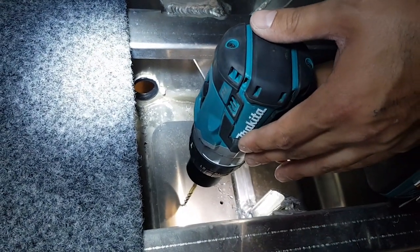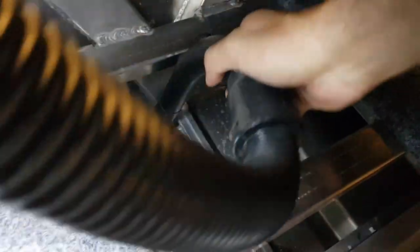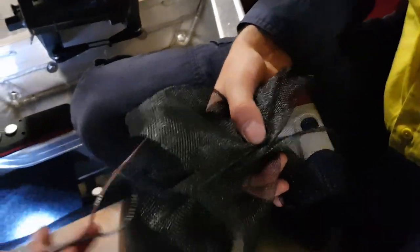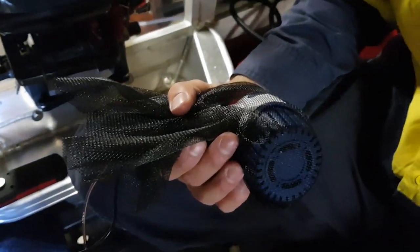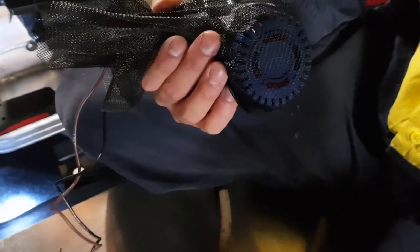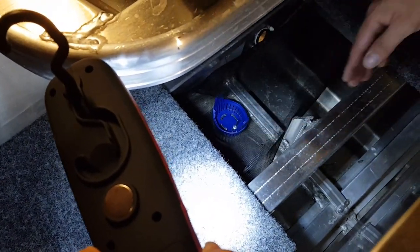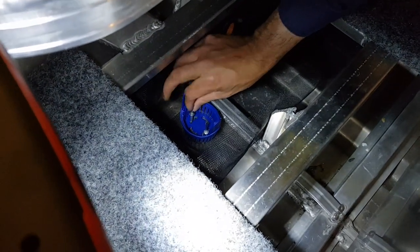Don't go to the bottom mate. A way to stop little off-cuts of your braid or your mono or things like that, and sleeves and stuff blocking up your little propeller - put some fly screen over the top. So I'm going to give it a crack. We're going to pop rivet these in now with the fly screen on the base because that would be the best way to do it. So a little trick: don't put your first pop rivet all the way in so you can maneuver it around.